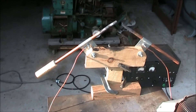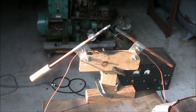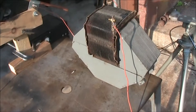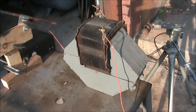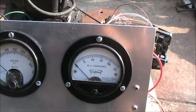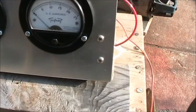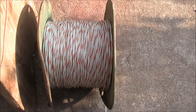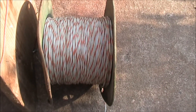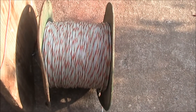The final experiment with this generator is going to be an arc load, so we have the two carbon electrodes. I'm using an arc stabilizer since this is only single phase, and we have a metered full-wave bridge rectifier and also a spool of wire in series with the arc that limits the current — about four and a half ohms — so this should keep us under 20 amps.